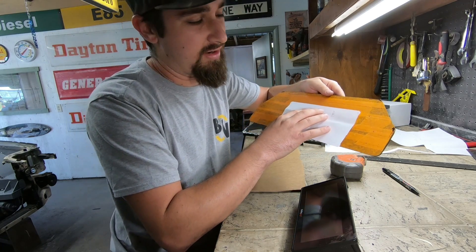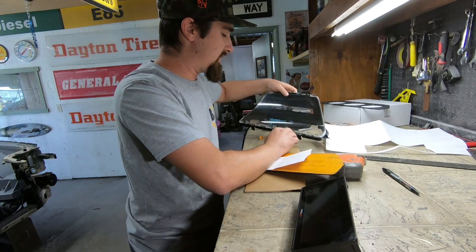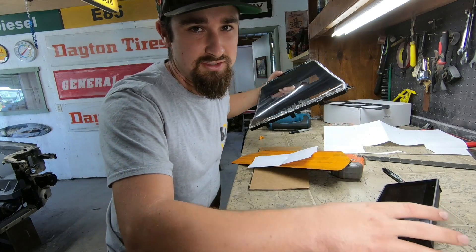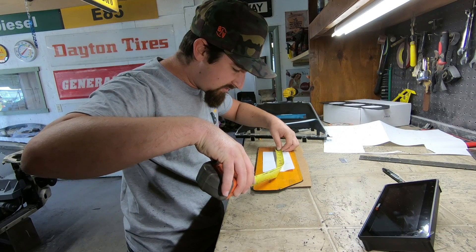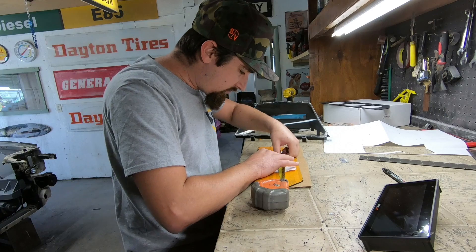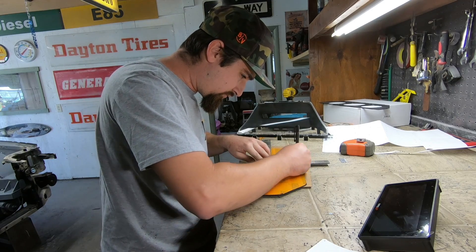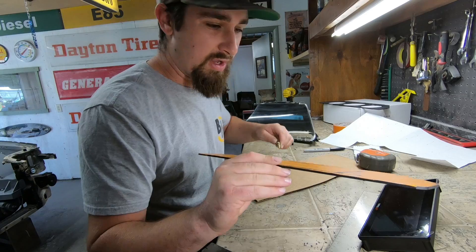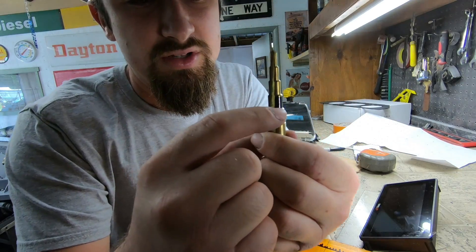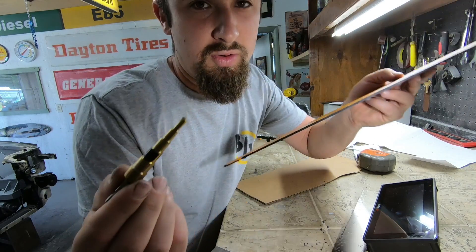Since I want to make this centered, I'm going to find the center point of this piece and the center point of the other piece and get those lined up. If I measure from edge to outside on both sides, those two numbers should be the same — I'll do that for left and right and for top to bottom to find the exact center. The measurement is seven and nine-sixteenths across and three and three-quarters tall — go just a sixteenth more than that. Now I'm going to make a hole on each of the four corners using a three-eighths step bit. I like to black off the three-eighths mark so it's easy to see when to stop.